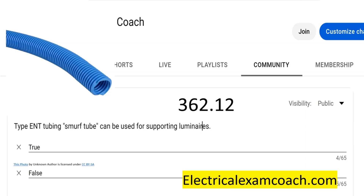It's not permitted in theaters, except as provided by other parts of the code. Remember, this is the national exception code — you can't do this, except in XYZ. And it's not permitted when exposed to direct sunlight unless it's identified as sunlight resistant, which most of it probably is. And it's not permitted where subject to physical damage, which is kind of a blanket statement they make for tons of different pieces of equipment and fittings.